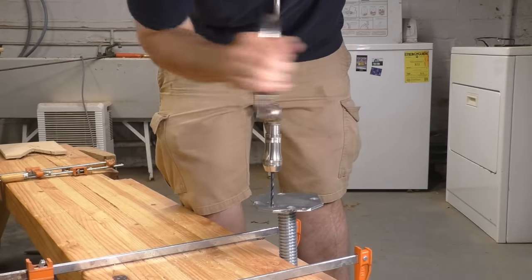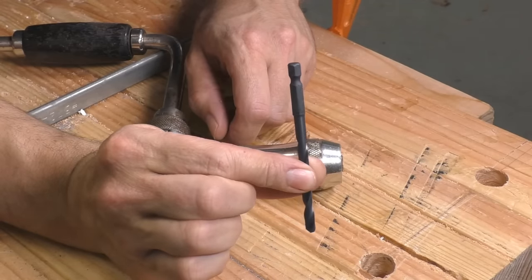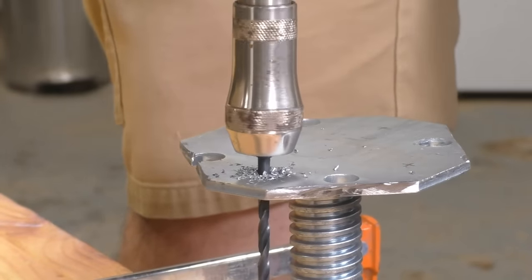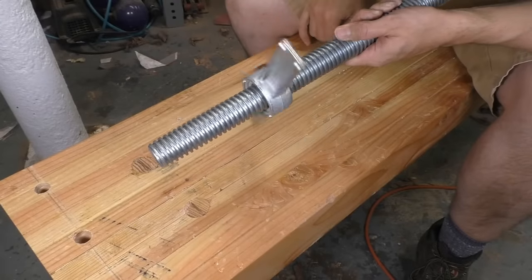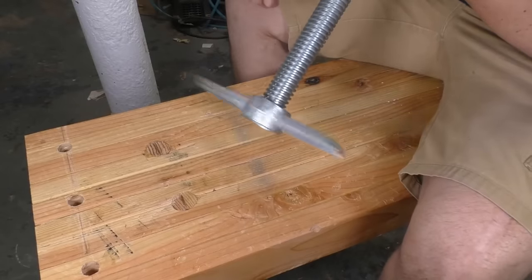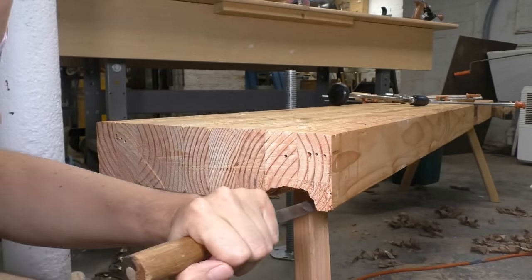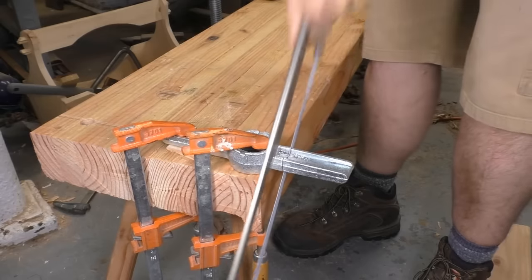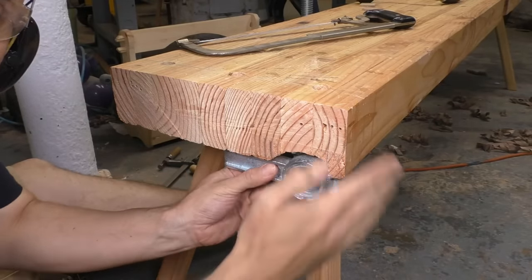Once you've got the end plate cut to size and cleaned up, you're going to need to drill four holes that we'll later run screws into. I found these inexpensive hex shaft drill bits — these work in pretty much every bit brace and cost less than $10. Just like cutting through this plate, drilling through it isn't very difficult. The threaded section has one part that's crimped to keep the nut from coming off, but we're going to need that nut to come off, so we'll take the file and clean up those crimped threads. Position this nut under the bench about one inch from the edge — you might need to chisel out a little bit of wood from the underside. Mark the part of the wing that sticks out on the side of the bench, cut through that with your hacksaw, and clean it up with a file. When you're done, this nut should sit snugly on the underside of the bench and be flush on one side.